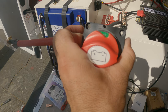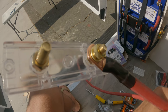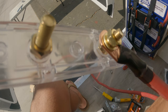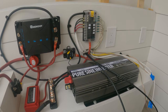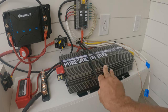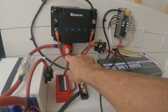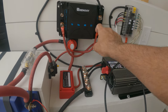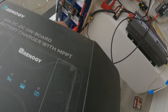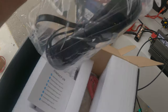Then this will get screwed to the wall. Here's the 250-amp fuse — from the other end of this we'll go directly to the battery. There'll be a fuse in the middle of these two. Almost everything's connected now. The last things to connect are going to be the solar cables coming from the panels. I have to route them the way I want — the positive will connect here, the negative here inside the charge controller box. They provide you with the terminal connections that will crimp onto the end of the solar cables.